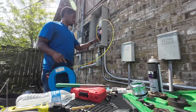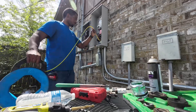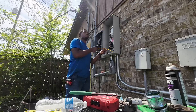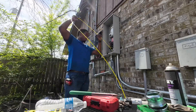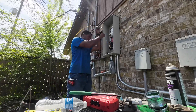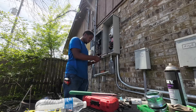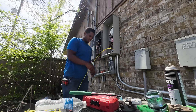Right now I've got my insulated fish tape and I'm sending it through the three-quarter-inch conduit to where my journeyman is located. He's going to tie off the wire on his end and I'm just going to pull it through. Whenever you're pulling wire, you want to make sure you have enough length — I was always taught to take it to the top of the panel. It wasn't a hard pull at all, pretty easy. Everything lined up perfectly. Now I'm sending it through the inch-and-a-quarter EMT.